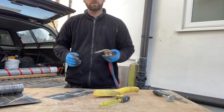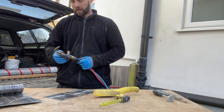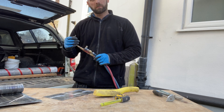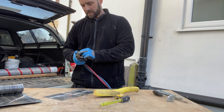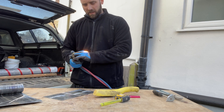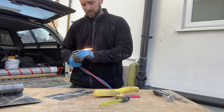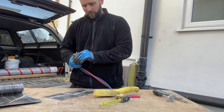What we're using to weld this is oxy-acetylene gas and we've got a Model O torch with a number three nipple on the end. Some people use number two but I've always used the number three. What you do first is light the acetylene — it might take a little while to come through at first. You want that flame to be about two to three inches, and then slowly introduce the oxygen. As you do that you'll see the flame changing and becoming much brighter.